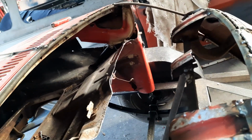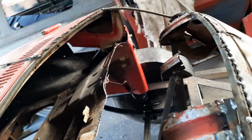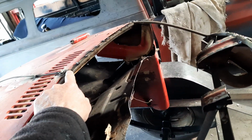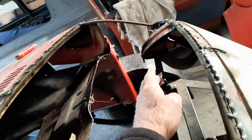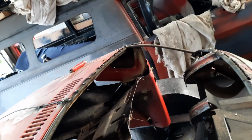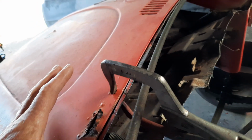There will be another one, because that can still flex just a little bit. So when I've got everything in position, I'm going to put another piece of rod up across the centre, and I'll then put a bit of bar, a bit of something anyway, onto this other rod, and then the hinges can't flex at all. Right, and then I've retied and moved the bonnet, got it back into position so that it's all lined up with this edge here.